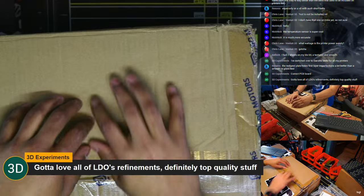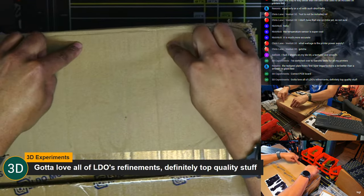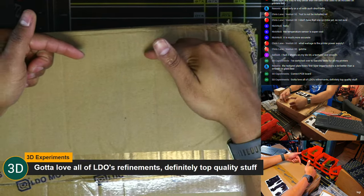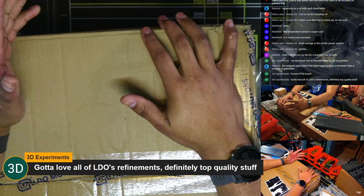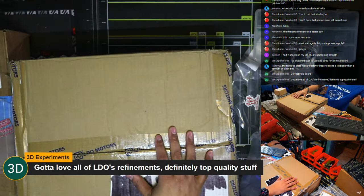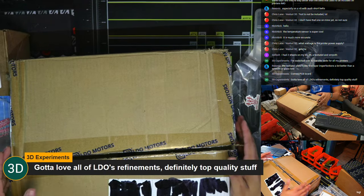They've rearranged all of the IO on the board so that the ports for the AB motors are up top. So you have a very short run from the AB motors into it. And that's the first time I've seen that. Obviously some custom printers are probably going to have custom boards arranged to be optimal for that printer. But that's the first Voron kit that I've seen that has a custom board specifically designed for a custom printer.